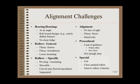To finish, there are three situations that are most demanding. Any machine that runs metal foil is so demanding that we can't usually measure roller positions well enough to satisfy its stiff, high-modulus requirements. Similarly, closely spaced rollers need to be even more closely aligned so the web doesn't need to make a sharp in-plane bend in a short distance. Finally, wheels are impossible to align because of their short gauge lengths.